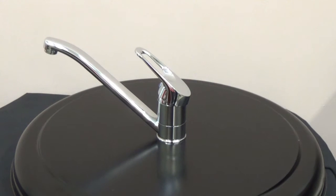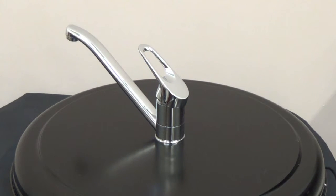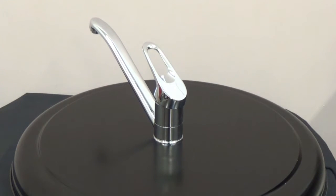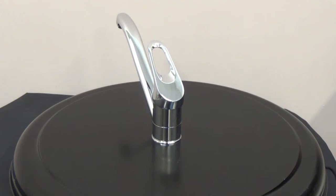The minimum working water pressure is 0.5 bar and the maximum working water pressure is 6 bar. Reginox, the manufacturer, has built these taps using ceramic disc valve technology, making them easy to maintain and service.